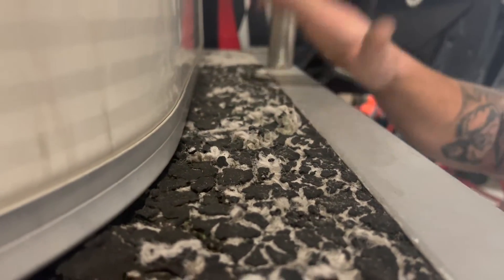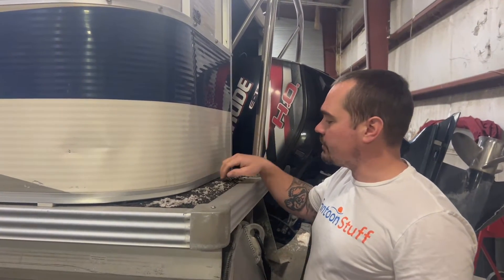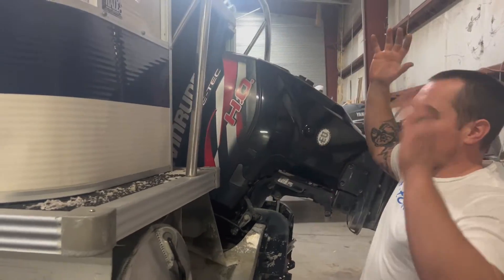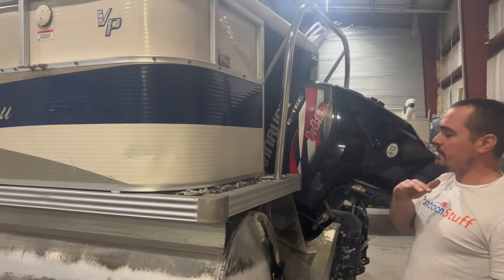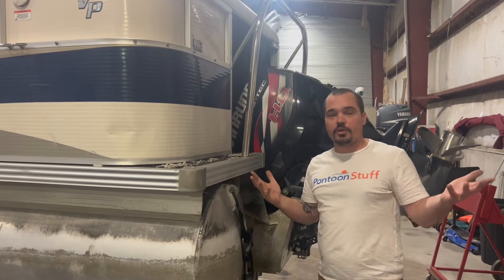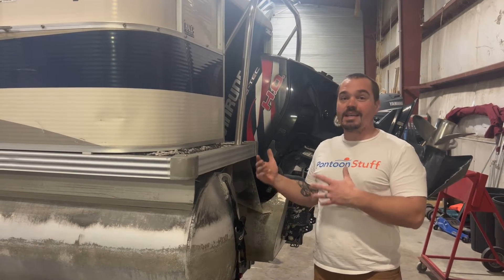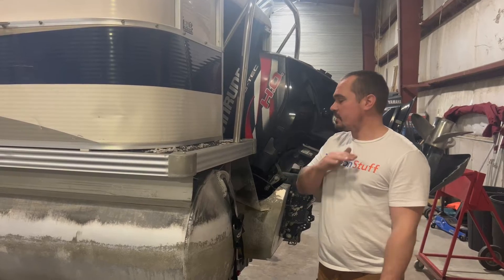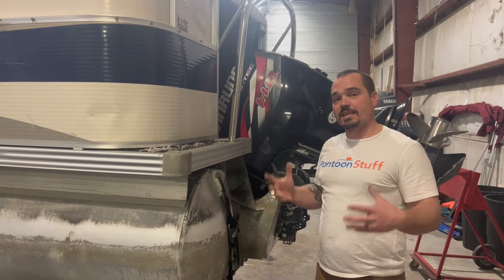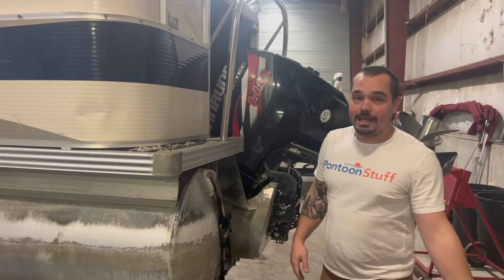So the carpet's going. This is getting a vinyl weave, the Deckmate vinyl weave from pontoonstep.com. Everything's going to come off. We're going to take this boat down all the way to the bare bones, put new plywood on. It's only 12, 13 years old. Why replace the vinyl when the wood might wear out in the next 10 years or so? So we just start fresh, all new. That way we know that the glue is going to stick well to the plywood. We make that investment once in the boat — it's going to last a lot longer.